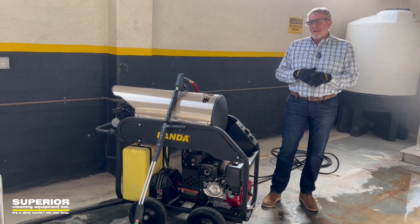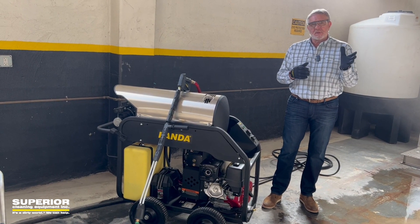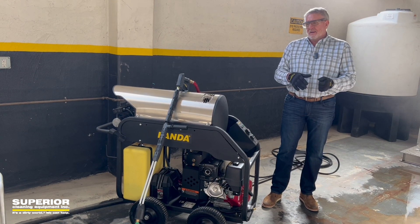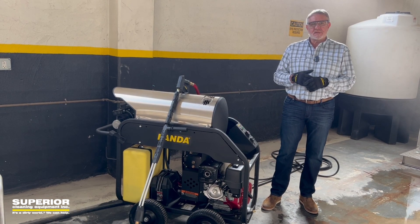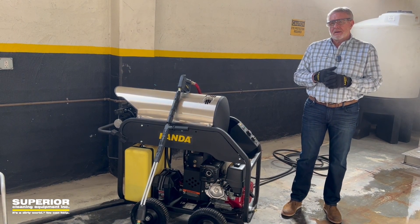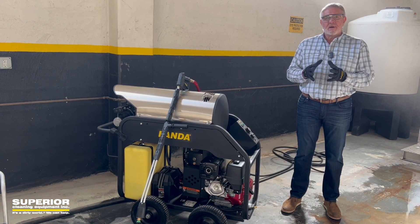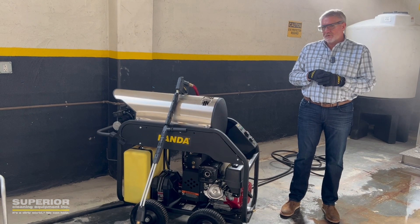On a cold water machine hooked up to a water source at your house, same kind of thing: pull the trigger, turn the choke on, pull the recoil, start the machine, then turn the choke back off — otherwise you'll get a vapor lock or water lock. Seems kind of simple, but we hope it was helpful. We'll post more videos on these subjects in the future. Thanks for watching. You can see all of our equipment and videos at www.sceclean.com.